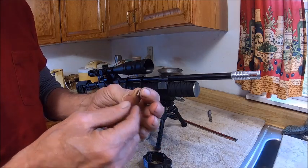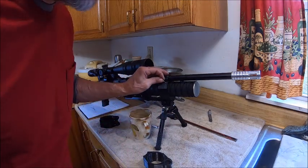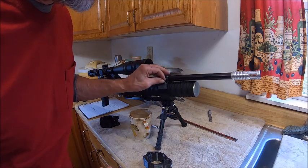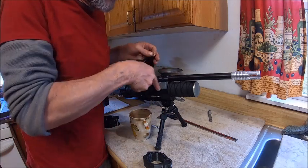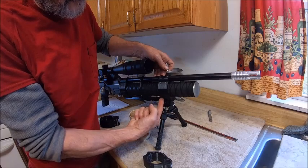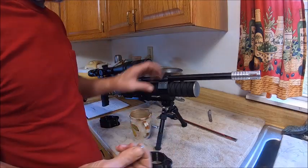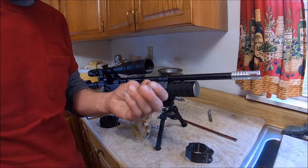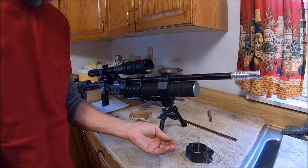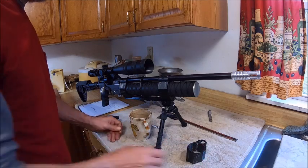So we're just using flat bottoms on it. These are oriented in a way that that flat part hits flat against the tank. So basically, if I was to drill that straight on through, it'd be directly across from it. Same thing with this one over here. You want it to be in an X pattern. If there were set screws under here, they would go across from each other. So that's the set screws that this will go with. Now if somebody wanted a different set screw for theirs and they wanted to change it, that's fine. But this one here, I'm going to make mandatory for this band.